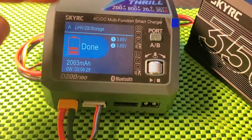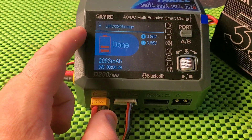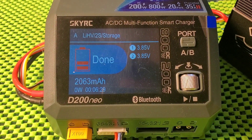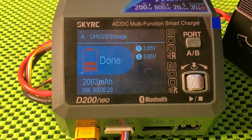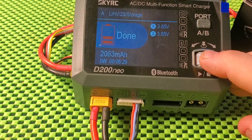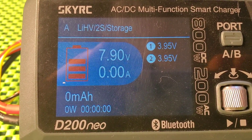What happens is — we just saw it start in the previous section. It says it's done and it beeps at you. But this screen is not live — it's kind of showing you the last values. That's why the time is not incrementing and the voltage is very, very steady. As soon as I press this button and make it live again, you can see that the voltage jumped up from 3.85 to 3.95.